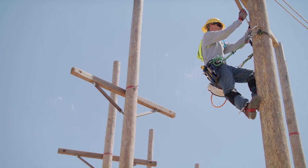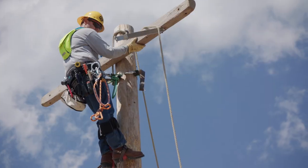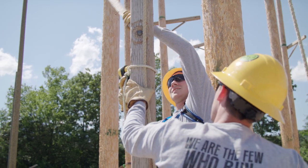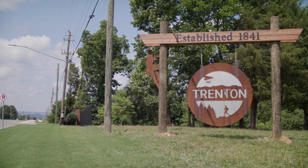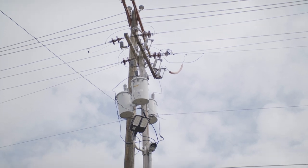The first competency that we do in the PC is building a single arm, and we show them how to build the arm and send the arm up and install it. You don't want to get it too tight, because remember, he's got to bring it in, but you don't want it flopping down. Okay. It's an 8-foot piece of wood. You see them all over town, you see them all through the city, you see them everywhere. They're wooden cross arms, have power lines on them. So we teach the guys how to hang them.